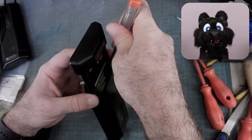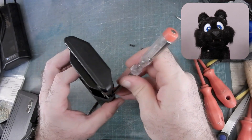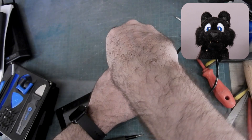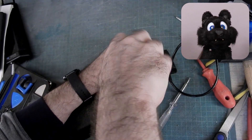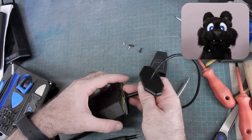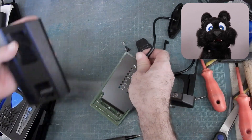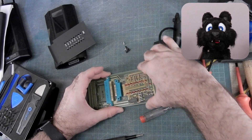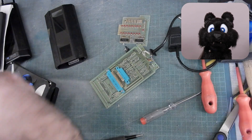Disassembling the devices is a bit on the complicated side, but who needs to read a manual? Turns out that you need to unscrew the top cover first, then you gain access to the main PCB screws, which then allow you to push the PCB through so the reference tray can unhook, and then you can pull the PCB on the top end again — kind of like a puzzle game. Yes, I could read the manual to find that out, but I love solving these things during the projects!